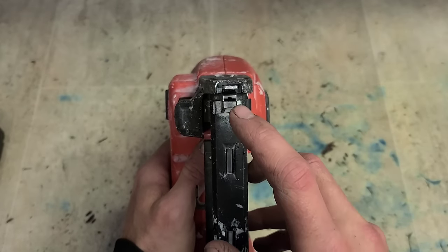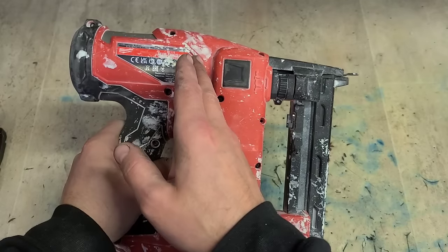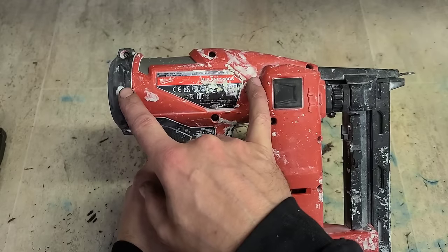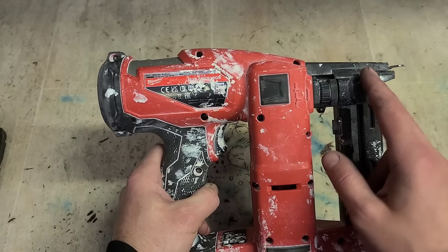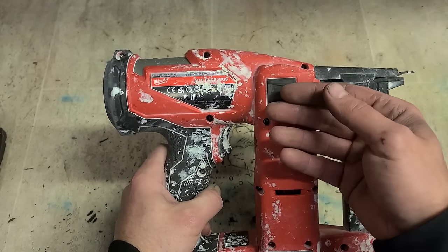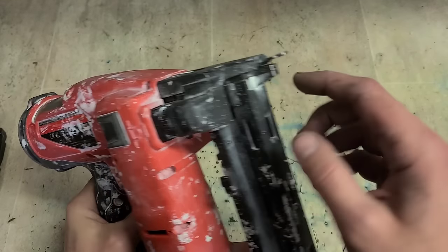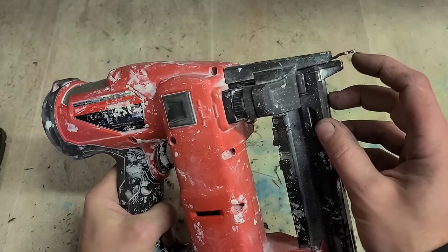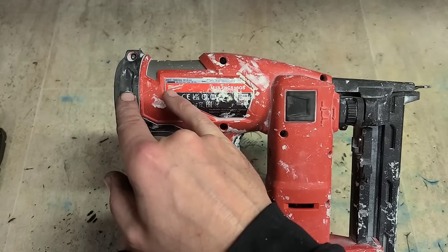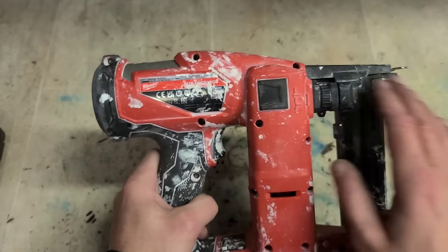The pin is not sticking out. Normally the way these actually work, they are under pressure. These are a pressurised gun like the Hikoki. So the back chamber is under constant pressure and the pin is trying to be shot forward. Even if the pin is shot forward, the back is still under pressure and it has to be ratcheted back to compress the gas even more for it to shoot. Once she is ready to shoot with the pin back again, the pin is either going to be back or sticking out proud. If the pin is back and she is ready to shoot, that is under maximum pressure - the pin has actually compressed all the air all the way back and she is under max pressure to shoot. So once the motor moves, she will fire.